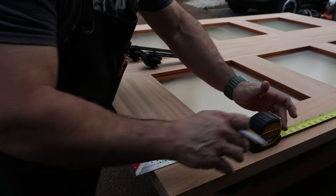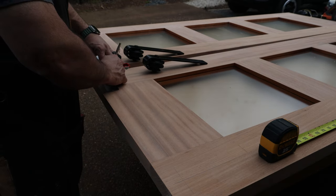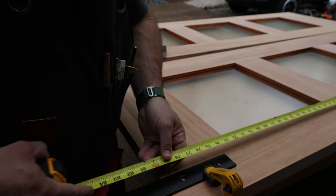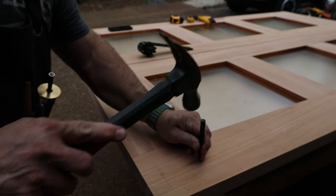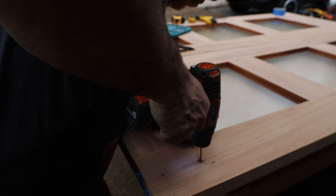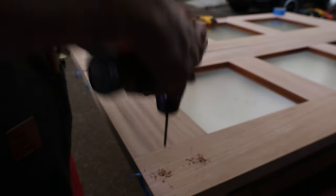Before we do the final finish on the doors, we have to prepare all the holes for not only the rails but also for the door handles. I want to make sure that the top is completely even when it comes to hanging on the rails - if the bottom is uneven nobody's ever going to notice, but if the top is uneven everyone will notice. In order to minimize tear out as I drilled these holes into the door, I did two things: I started with taping the back of the door and I also took three different incremental passes to get to the final diameter of each hole.